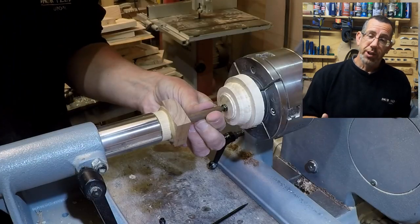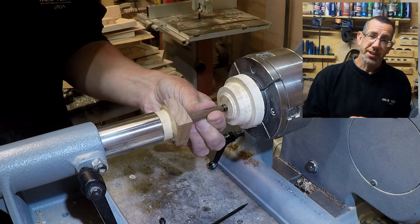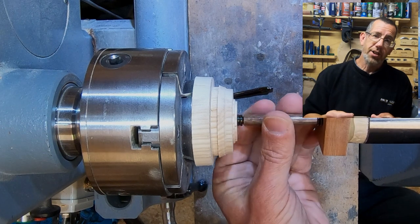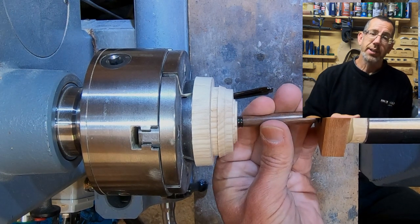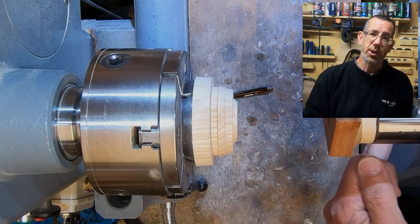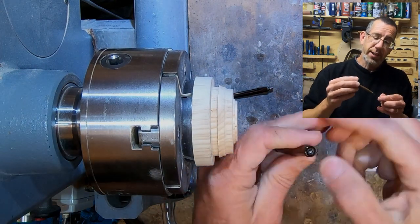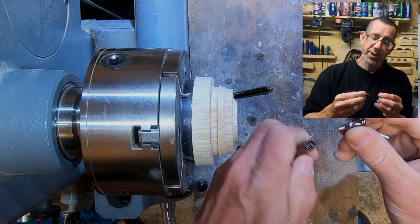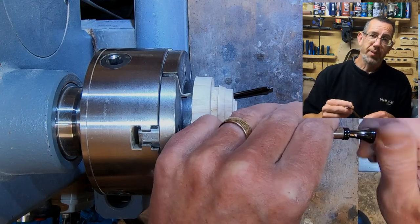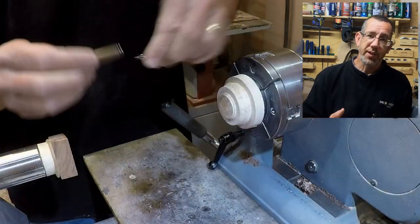So that does work really, really well, certainly with things like CA finishes as well. Melamine lacquer is supposed to fully harden over the course of a few days, so it does build up a lot better finish over time and becomes a lot more hard-wearing. This particular one has a slight gloss to it, not a high gloss. I've put several coats of melamine lacquer on this, but I've been very, very thin.